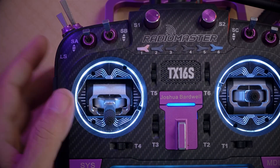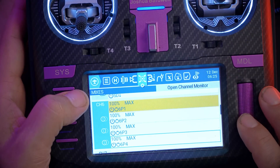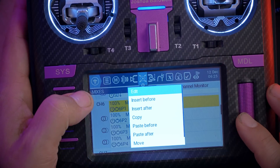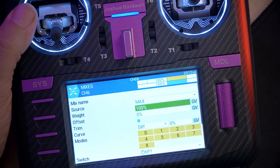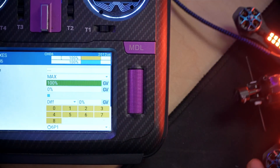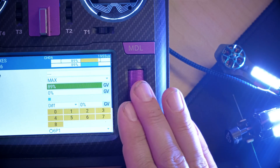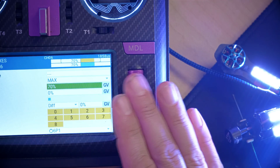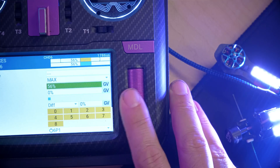That's going to depend on what colors we want from our LEDs, so let's figure that out. I'm going to press number one on the six position switch so that very first line becomes active. Then I'm going to scroll up, edit that line, and highlight the weight parameter. The weight parameter controls the value that is output when you have max selected as the source. As I change that weight parameter, the colors of the LEDs will also change. The very first one is going to be 100%, which is red.